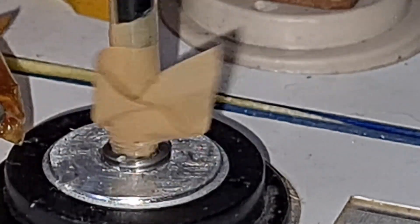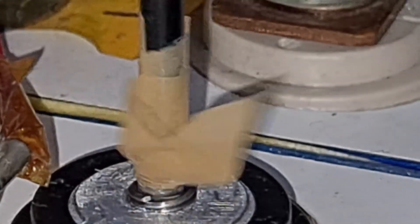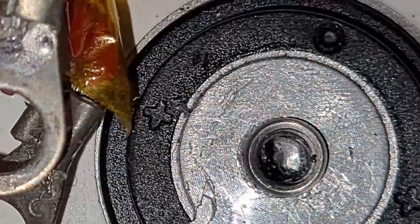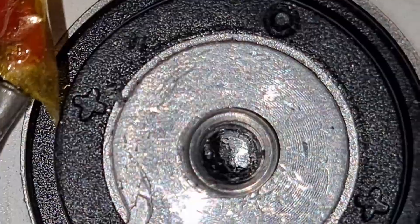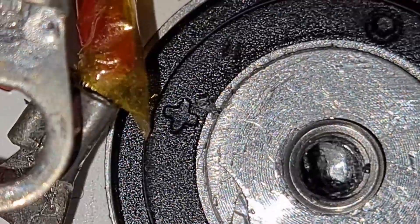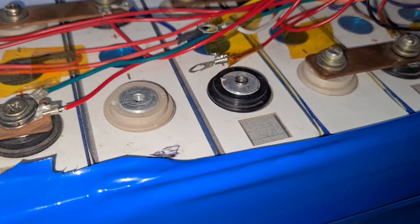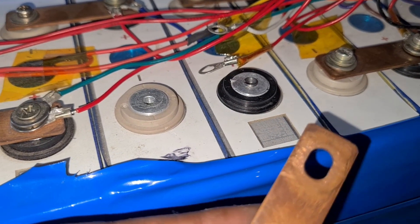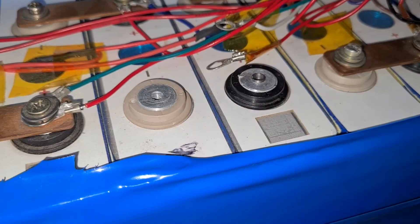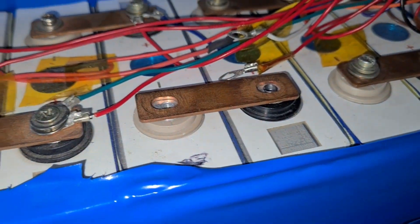It did go in, and that's the maximum I was able to push it. That's the drilled hole reinforced with the helicoil spring. There is a small bit still on the top — I'm just going to leave it as it is because the copper bus bar has a small hole on it, so it's fine.